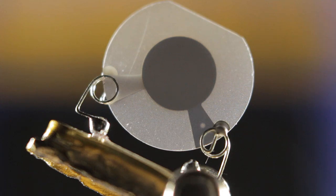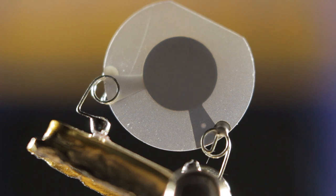Hopefully this was interesting. Hopefully it wasn't too anticlimactic, because I was hoping that the crystal might be a bit bigger. I mean, it's really the frequency that dictates the size of the crystal, so it may have made sense for some models of crystal to actually use a smaller crystal inside the big one, and then for the lower frequency crystals actually use a large physical quartz cut. Maybe the reason they do this is so that they can sell all the different frequencies in the same package.